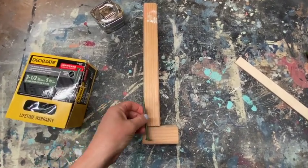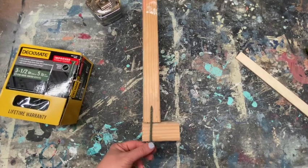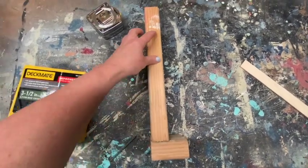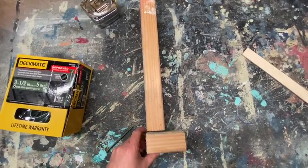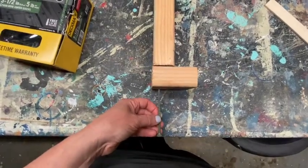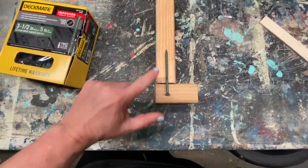So, real quick, a small scale representation of the actual garden beds that we built. I just wanted to show you how I fastened the tops and the bottoms of the boards onto the sides. So the longer piece here, pretend this is the 8-foot section, and then these are the 2-foot sections. The 2-foot sections I butted up to the end of the 8-foot sections, and then I took our decking screws and fixed it from the front of the box straight through into the sides so that when the screws are anchored in, they're long ways.